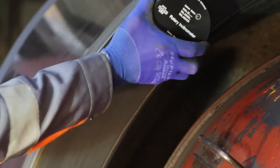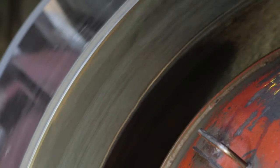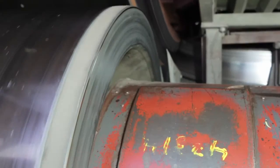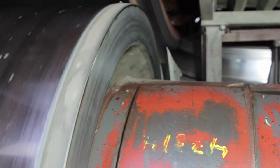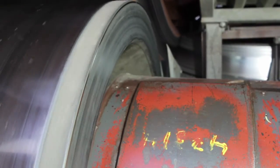If the roller shaft is not accessible, the inclinometer might also be placed on the side surface of the kiln roller itself. Before doing so, make sure that there aren't any heat shields or scrapers installed on the roller. These could interfere with the inclinometer.